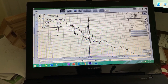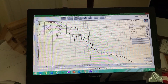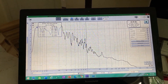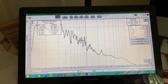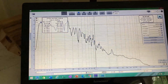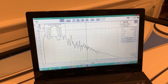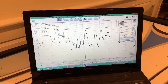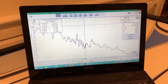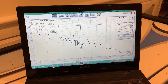I'm curious what's going to happen if we turn this computer off. The computer's shutting down. Look at that — it was this computer. This is an old iMac from 2009, and when it's on it's creating a 99 Hertz hum. Let's go back downstairs and see if we can still hear it. We're right below where it was the worst spot, and that 99 Hertz and even the 60 Hertz has died down quite a bit with the computer being shut off. So that was the problem.